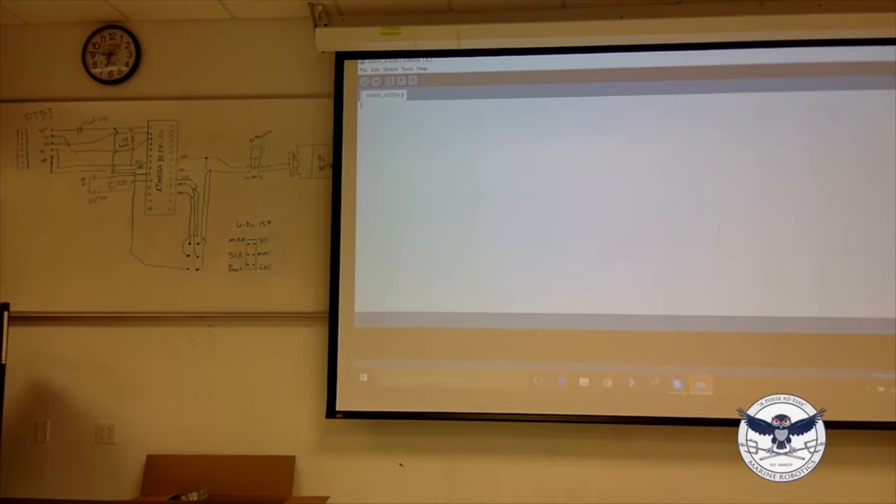Has anybody ever used this Arduino IDE before? To get it to compile, you need two functions minimum — both are return type void. The first one is called void setup, and the second is void loop. So in order for it to compile you have to have both of these. Done compiling — it's good to go.